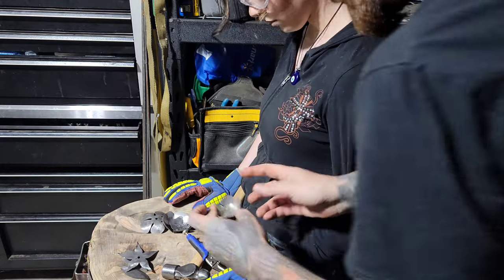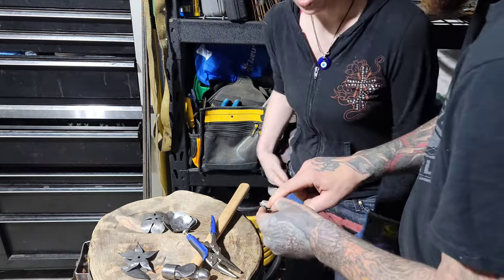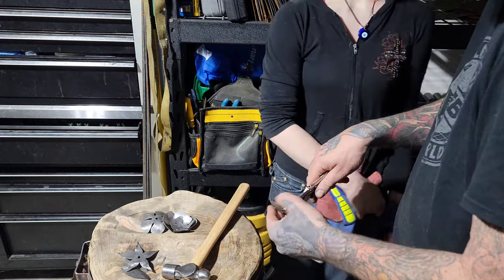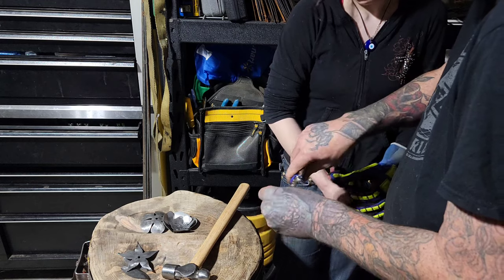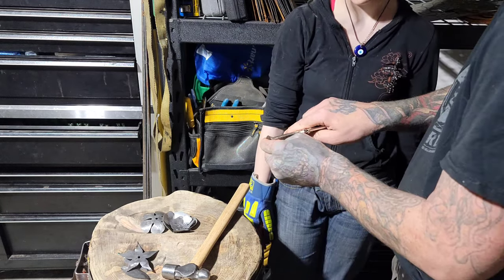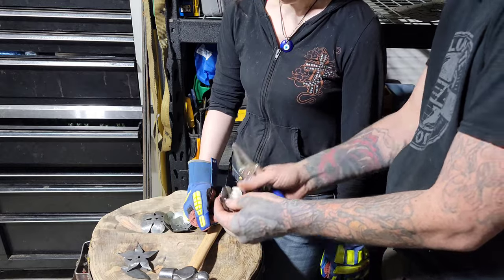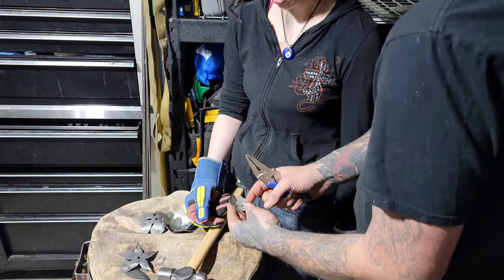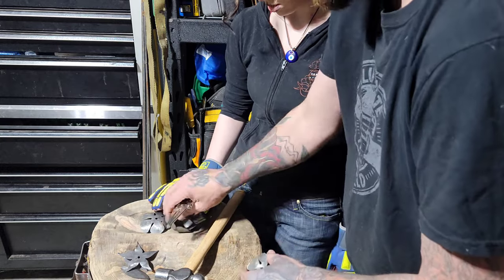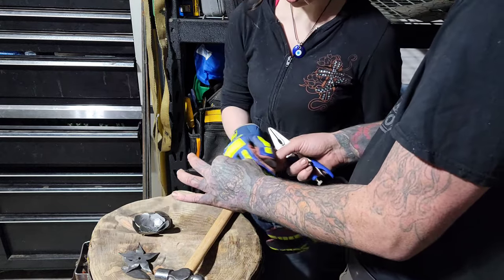The middle/center petal is going to roll up pretty tight, so get some good shape into it. Hit along the middle of these petals to cause them to roll in. You can also grab the petal with vise grips and literally roll it in — use a second pair of vise grips to get more control and roll them in fairly tight. These inner ones have to roll up close. Once on the stem and folded up, the innermost petal sucks in very tight, the next one a little less, and the outer ones are almost open — ending up this big around in the middle.